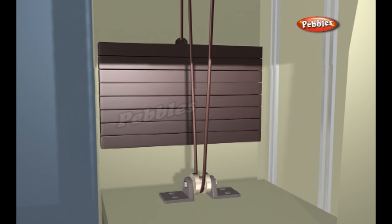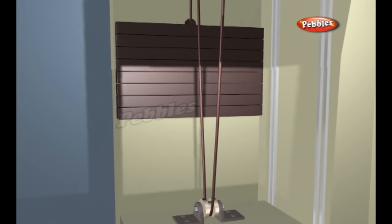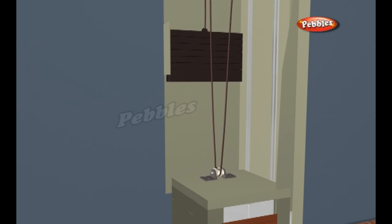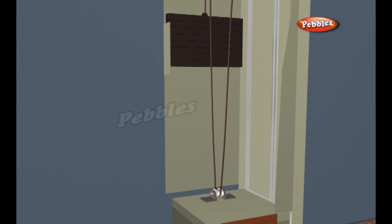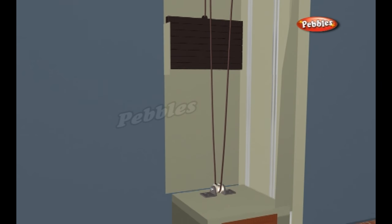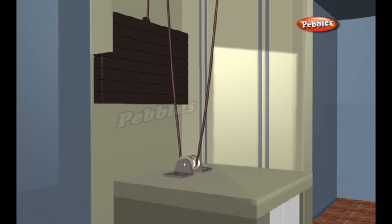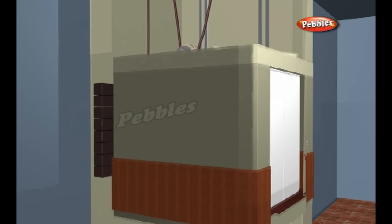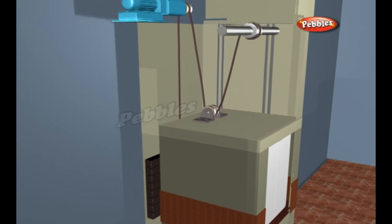The purpose of this balance is to conserve energy. With equal loads on each side of the sheave, it only takes a little bit of force to tip the balance one way or the other. Basically, the motor only has to overcome friction — the weight on the other side does most of the work. The balance maintains a near-constant potential energy level in the system as a whole. Using up the potential energy in the elevator car builds up the potential energy in the weight, and the same thing happens in reverse when the elevator goes up.